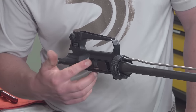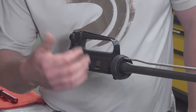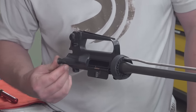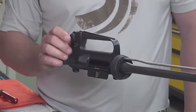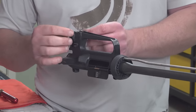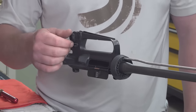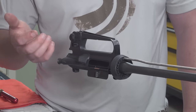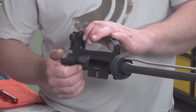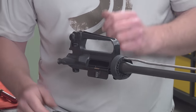Same thing with the dust cover — as long as the spring has good tension and the detent is strong and stays shut, you're good. No need to take all this apart for field stripping. Same with the A2 rear sight base: it's a relatively complicated contraption and you don't want to take it apart unless something's broken. Plus, if you've taken the time to zero your iron sights really well, you don't want to mess with your zero. The upper is now pretty much ready for maintenance.